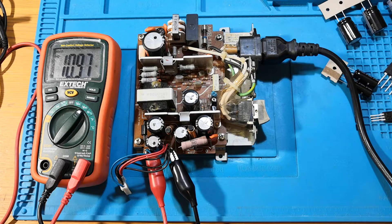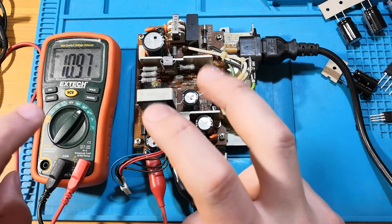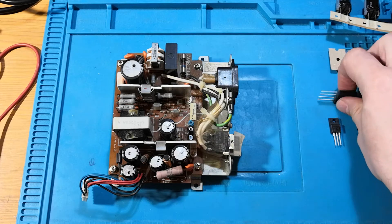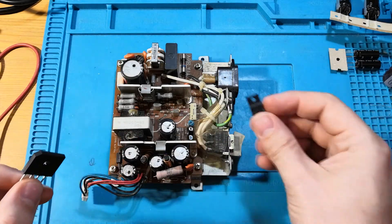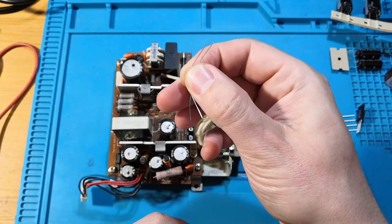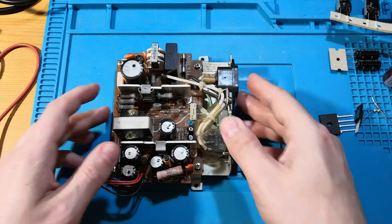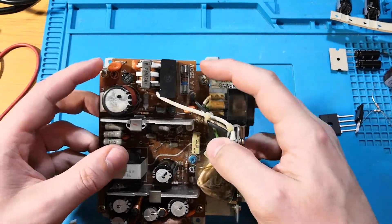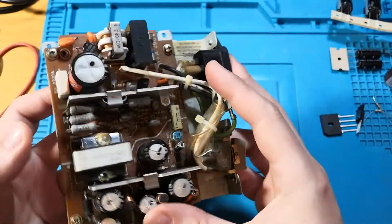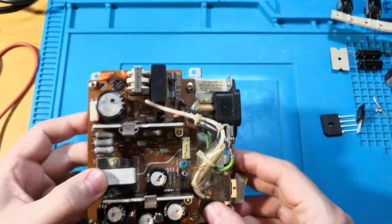There's nothing in the ST that uses 12 volts really — I've not got a floppy drive in it anymore, so it's probably good enough. But having decided that the power supply is probably in need of some care and attention, I've got all the various capacitors. I've also got a new rectifier and one of these. I'm not quite sure why I've got two resistors. First step is to take this to bits, take all these off, take off the connectors so I can get the board out, and then start desoldering things.